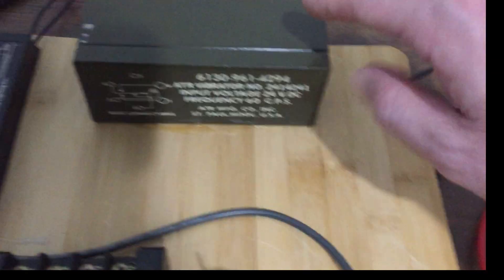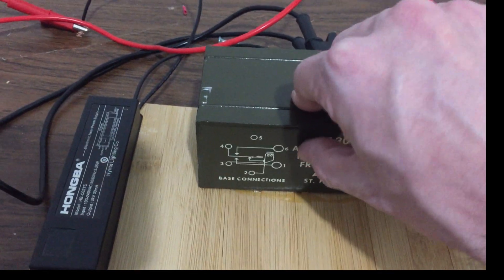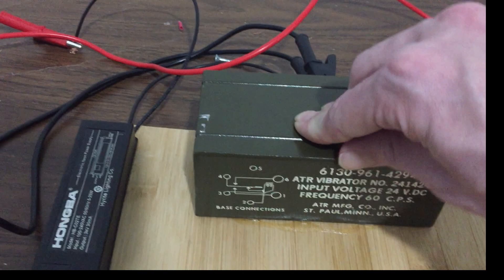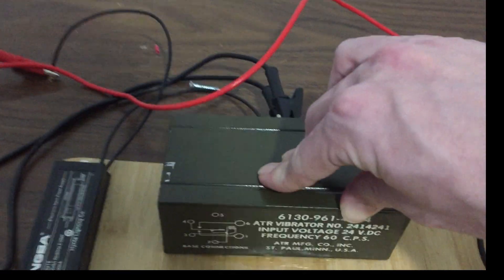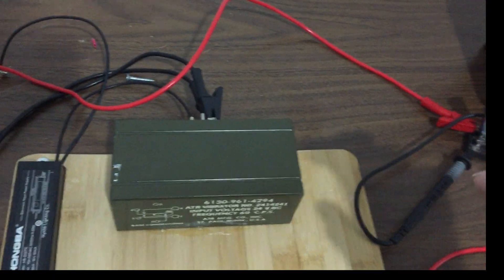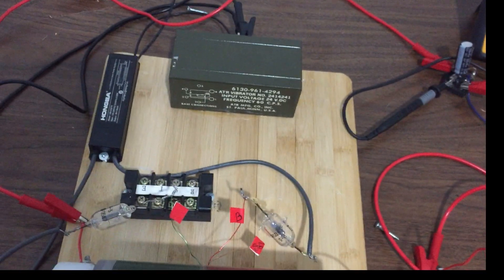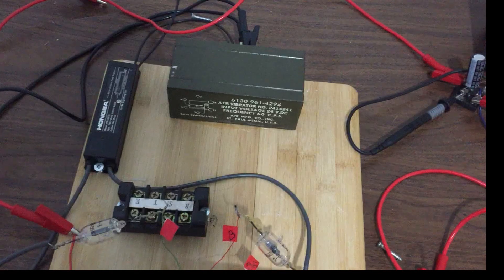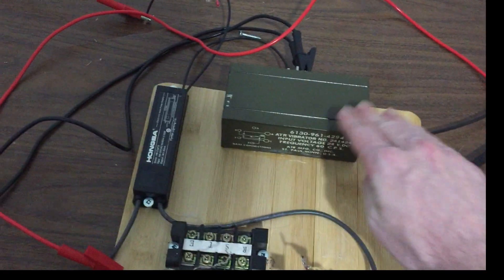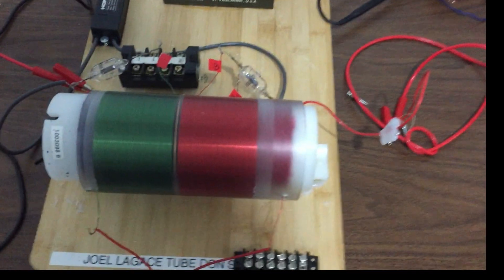What's interesting about the mechanical here is that not only do we get chopped DC, but we have a real mechanical relay — essentially a mechanical transistor operating at 60 hertz. You could use one of the pins here to dump your potential well at 60 hertz back into the system without needing an extra switch. With digital circuits you have to worry about lag, interference, jitter, and compensation. The mechanical way gives you completely synced operation, and phase really matters with this kind of stuff.